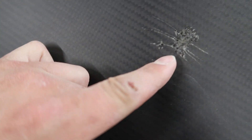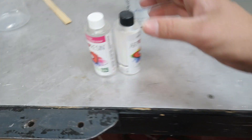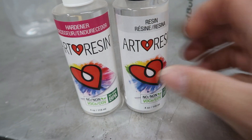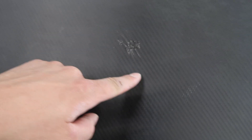We're going to be repairing these holes with a two-part resin and hardener. I believe it's a one-to-one mix ratio. First we have to prep - I'm going to get this masked off, mask a square around the damage, and then sand it down some. Using 120 grit sandpaper on a block so it won't dip down and sand the carbon fiber itself - we want to attack just the resin around it and scuff that up.